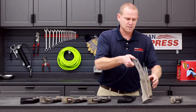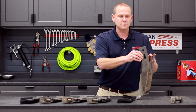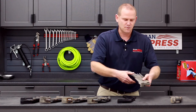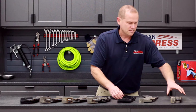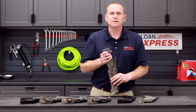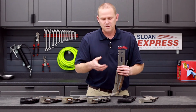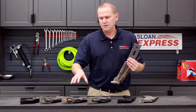Just like what we talked about on the mole knives, the same thing on the mini moles. You can do different tube configurations. We can get that for you. Same thing here, it's got that lifting action, real small for real low soil disturbance. If you get into a side dress application and maybe in the late spring, early summer, you're looking for something that's going to still have that general lifting action, but also not have as much throw of the soil like you would with a mole.